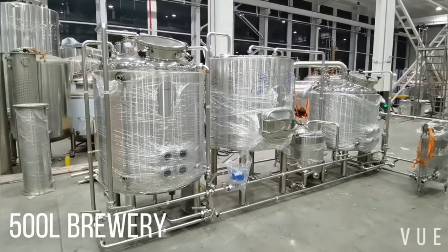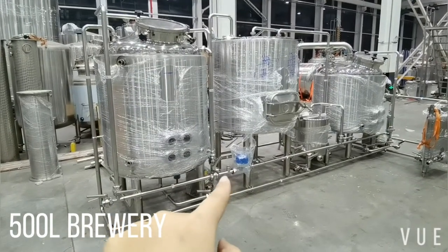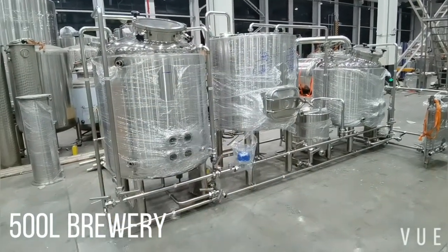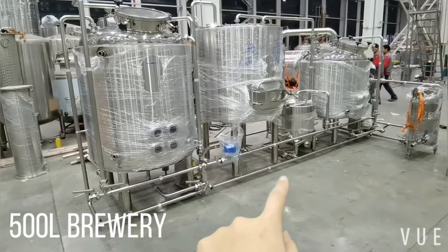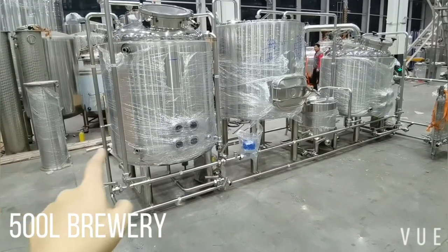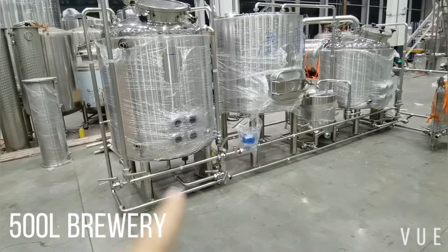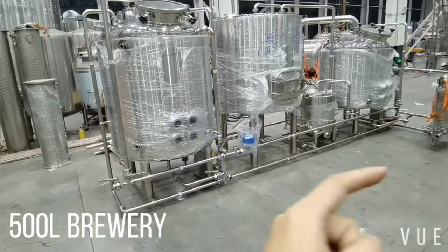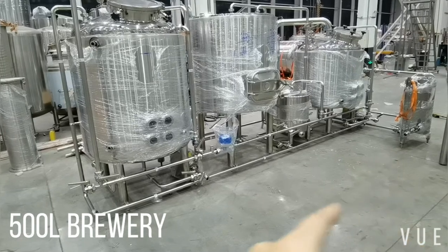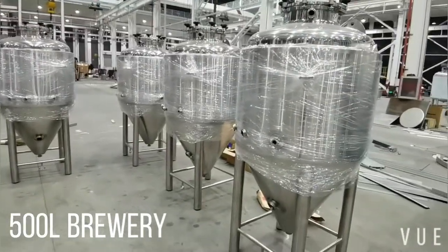In summary: on the upper pipeline, this is for tap water inlet — open each valve at the bottom to let water into each tank. On the lower pipeline, this is for warm water coming back to the hot water tank. On the back, the long pipeline powers the condenser inlet and the plate chiller cooling water inlet. That is the function of the back pipeline. Here is the full fermenter. Thank you.